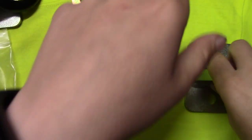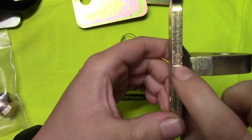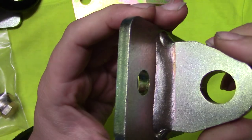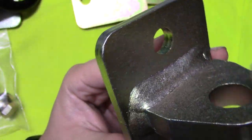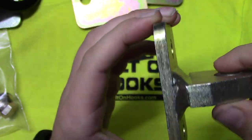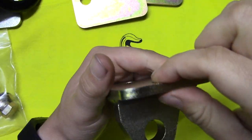Let's take a closer look at these. This is all zinc-plated steel, laser cut — you can see the pierce mark from the laser right there. Really nice cut all the way around and really nice-looking welds. You can see the angle on the welds is really nice too. This part here is half-inch thick, and this section is quarter-inch.